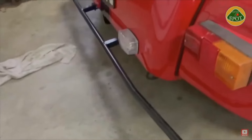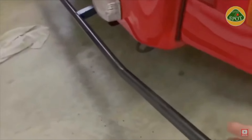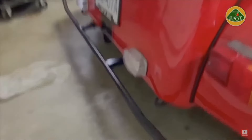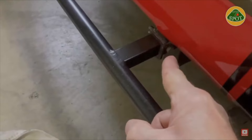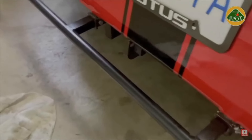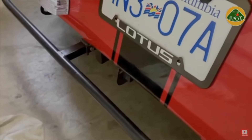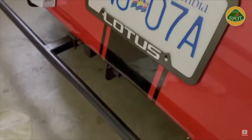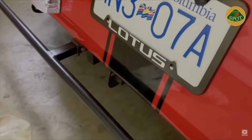Another thing to show you is my rear bumper. It's very light. It's a big piece of aluminum tube that slips into these — basically they're like mini trailer receivers that I made up. Just square tube with an X-size square tube welded on top of it, and a bolt slid through them. The reason I did that is that I can pull that out and put a spare tire rack onto the back. Or you can always pull the bumper right off and just put a chain through one of the bolts to pull your car backwards if you want.